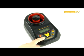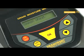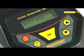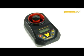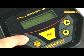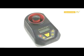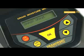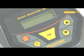To select another species of grain, press the cancel button and repeat all the steps starting from the choice of the grain name. After finishing the measurements, the tester should be turned off by pressing the ON-OFF button. The GMM is also equipped with an automatic switch which turns off the tester after 3 minutes of inactivity.